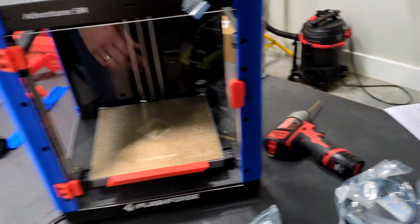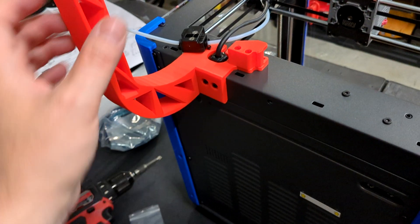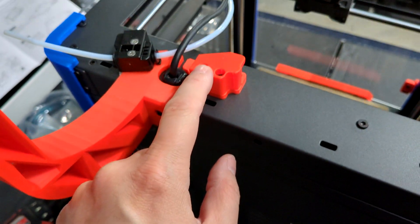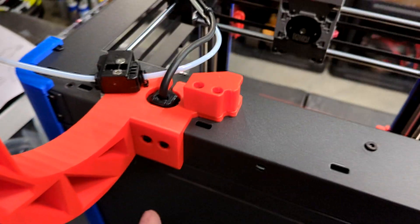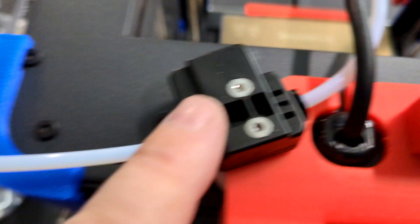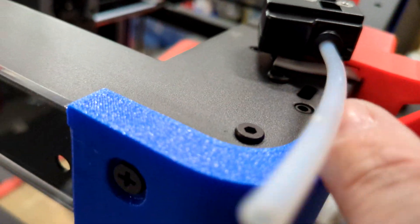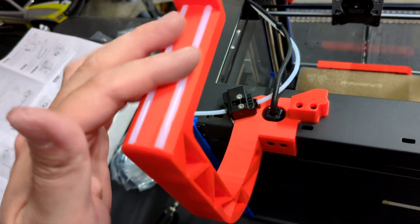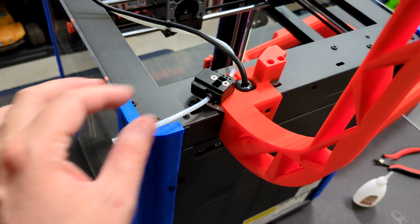In the back, the filament sensor was mounted here. We dismount that, take the filament holder piece and mount it with the other printed piece using the same screws. Then we pull screws out of the kit to mount this piece here, and two more screws mount the filament sensor right here — you can see it's plugged in underneath. Then you jam two pieces of Bowden tube down here to make a nice slick surface for your filament to roll on, with a little bit of Bowden tube sticking out for the filament.